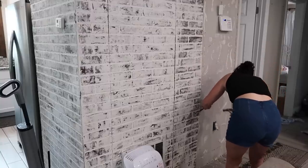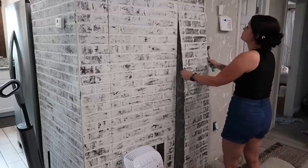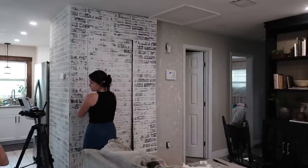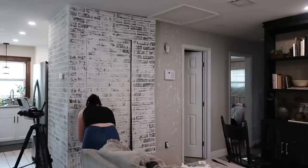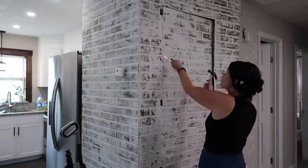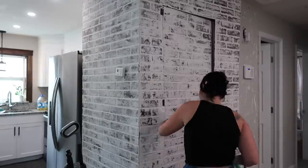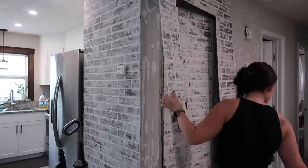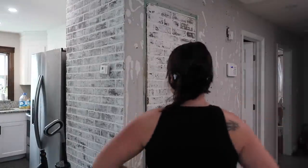I do regret using liquid nails because it caused quite a bit of damage to the wall and it was honestly unnecessary. I feel like the brad nailer holds things in place just fine without it. But there had been many projects before where I didn't use liquid nails and everyone was like 'you should use liquid nails, it makes it so much more sturdy.' It sure does, but at the end of the day with the type of personality I have where I like to change up my home a lot, the liquid nails just caused a lot of damage. The side wall by the kitchen — we did not use it and I removed it so easily with hardly any damage. You live and learn. If you're going to do these brick panels, don't use any type of glue or adhesive — just use the nailer. It's so much easier to fill holes than to patch an entire wall.